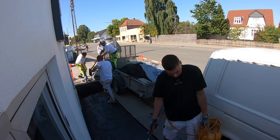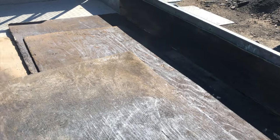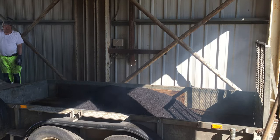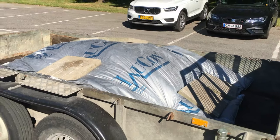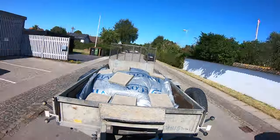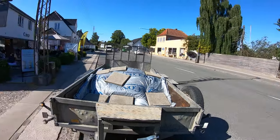Next, we are going to talk about transporting the asphalt from the asphalt plant to the job site. I personally like to keep my trailer clean — I lay some veneer plates on the bottom and on the sides of the trailer that are sprayed with diesel beforehand. The diesel makes everything unlikely to become sticky. Regarding planning, having trained people to help you is essential.